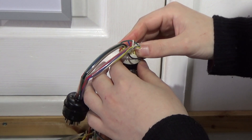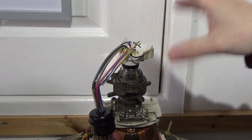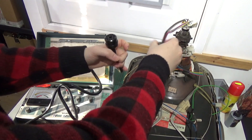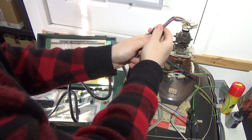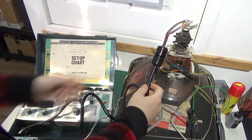So this just connects like so — just be careful with it, like that. This is your standard adapter; CR-23 is quite common. It might be a different pinout for different tubes, but this is quite a common CRT socket. And then all we do is connect this to the CRT tester, like so.